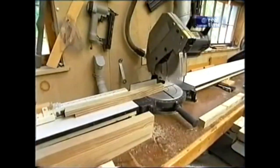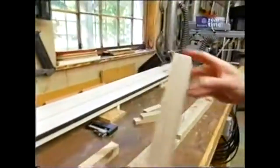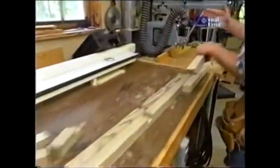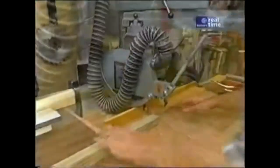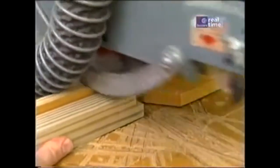The roof is pitched at 10 degrees. Therefore, the half-lap at the top of the frame has to be made at 10 degrees. I started by cutting the stock to length at the miter saw, which is set at 10 degrees — that gives me an angle on each end. Now I've swung the radial arm to 10 degrees and installed a stop so that I'll remove just the right amount of material.